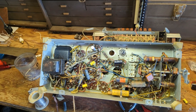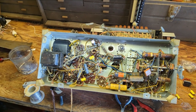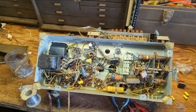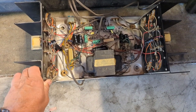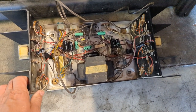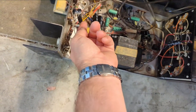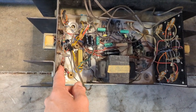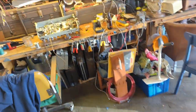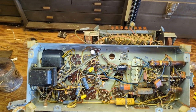I have to admit I'm trying to fix my own stereo system. I have a huge RCA Finlandia stereo system and one of my channels decided to mostly die. I've got a bad transistor — I replaced said transistor. It was going bad because two diodes in my rectifier section went out. I might have a bad driver here too, but I don't have those parts on hand. I'm going to focus instead on continuing recapping.